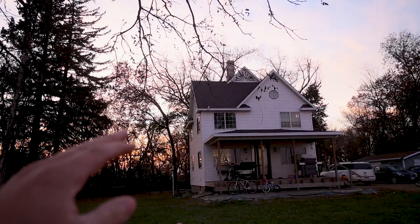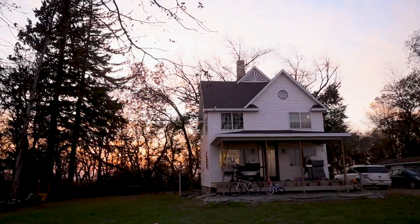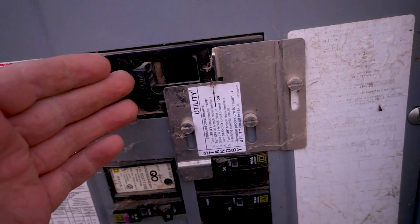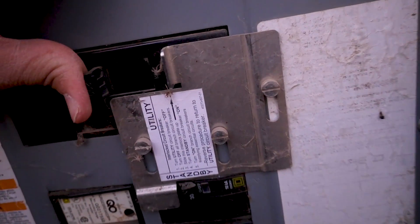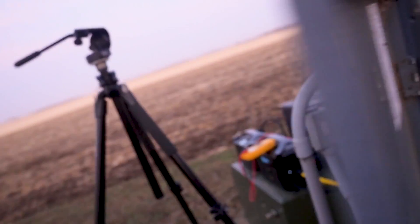This is the only proper way to do this, where you turn off the power coming from the utility. Sorry Naomi, hope you're done cooking supper. What I actually want to do is check the energy usage that we have right now on the Sense energy monitor before we turn this on. So I'm actually going to turn this back on, and check what our current power usage is so that I know if we're going to overload our power banks immediately or not.